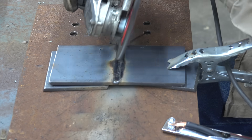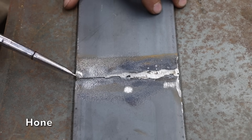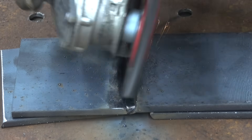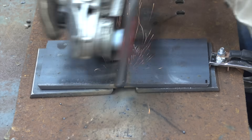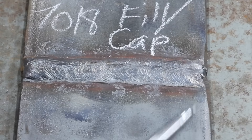The Hone is making plenty of current and a fairly stable arc to deliver a nice root pass. Joe's feedback: the Hone runs a good root, burning through 90% of the test piece with a steady arc, even weld legs, and nice concave passes. The Deco is definitely an upgrade from the Hone with a fairly stable arc and the best root pass yet — almost full penetration, smooth arc, and good consistency. The Yes Welder is another upgrade from the Deco with a very smooth and stable arc, though with a little inconsistency; a very nice-looking cap with a smooth bead.